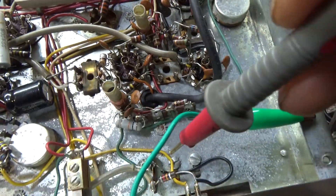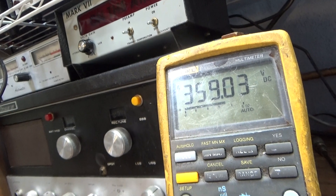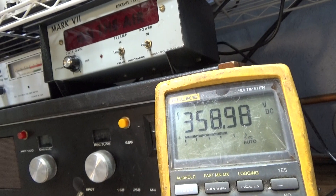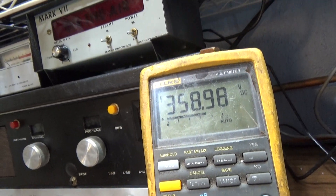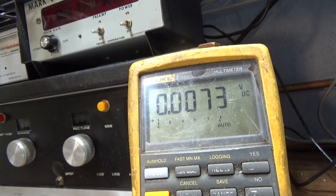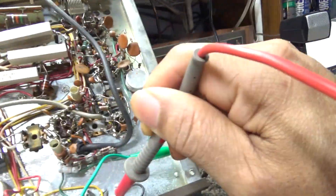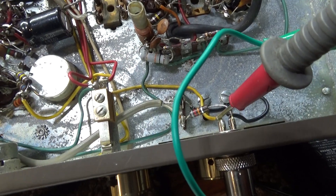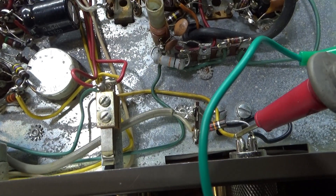You'll see the same thing at the mic jack — you've got about 350 volts at the mic jack. That's why if you touch or ground out the mic jack while playing with it, you'll get 350 volts — a good shot out of these Brownings, because there's nothing in line like a tube to knock that voltage down. I'm connected to the mic jack and hitting my foot switch. You can use a microphone to key it, but I only have two hands — one on the camera, one on the lead — so I'm using a jumper and foot switch.